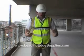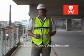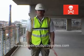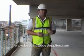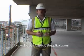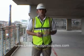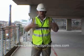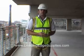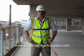The way I'm wearing my harness right now shouldn't fool you at all, because 99% of workers out there wear their harnesses as loose as possible for comfort. Wearing a harness like this will offer you no protection whatsoever. When we fall, we can experience up to 22 kN of dynamic energy — that's 2.2 tonnes. The way a harness is designed, all the energy goes into the back, gets dissipated around the harness, and ends up in the groin area. If I were to fall at 22 kN, my harness will ride straight up into my groin area like this.